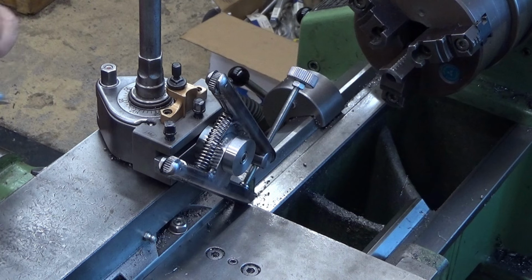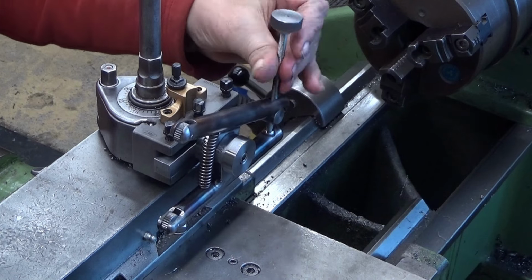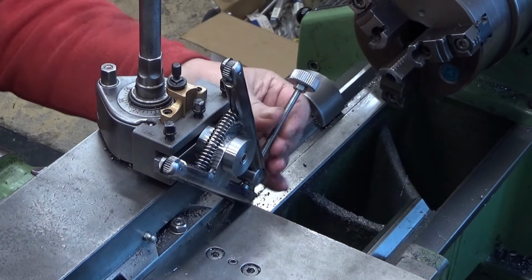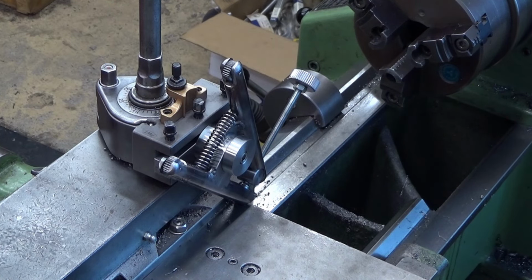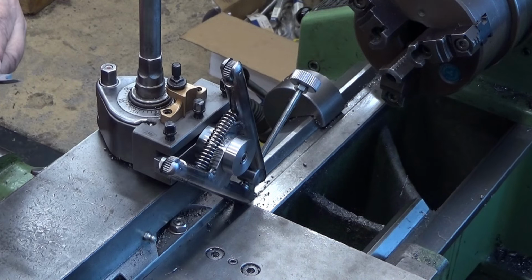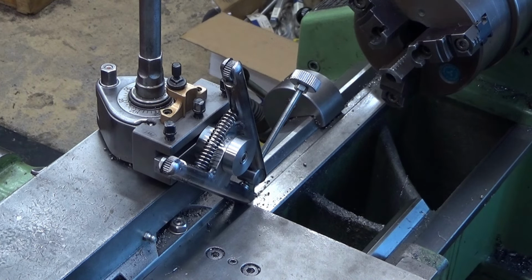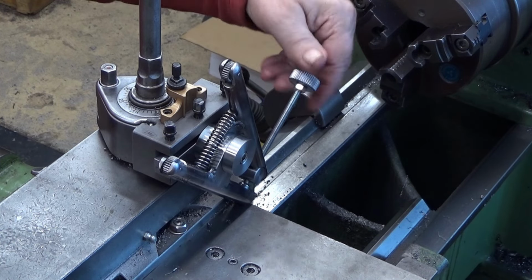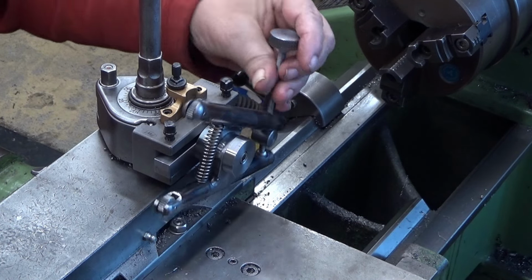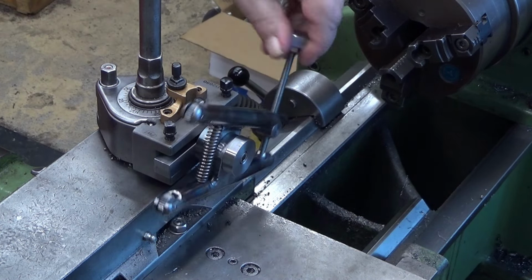Well, it's 55 millimeters the diameter. Well, it's already quite large. Yeah, okay. But you can go further than that. I think you can go over 60. That's the limit now. Oh man. Yeah, if you really, really need to knurl something of quite large diameter, 70 millimeters. Well, okay. And this is already like flapping in the wind. Yeah, I think the 55 millimeters is a decent one.